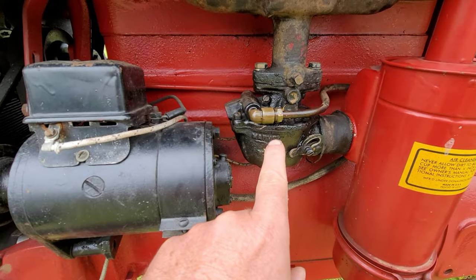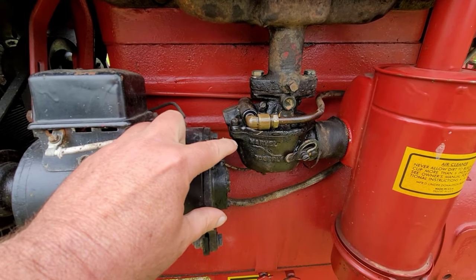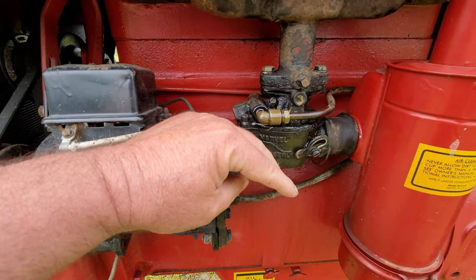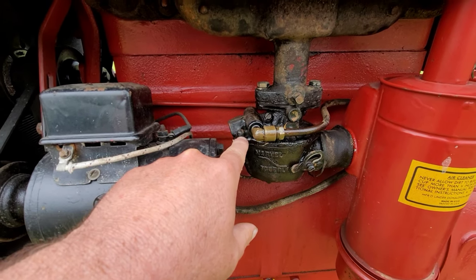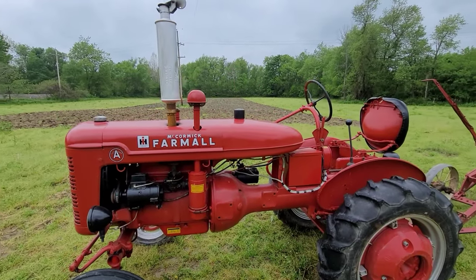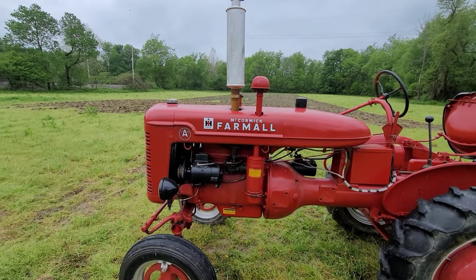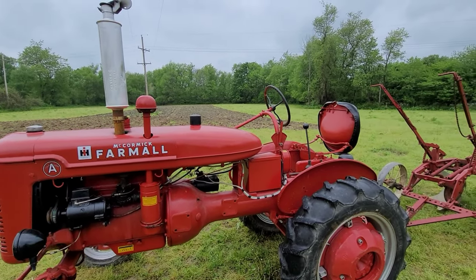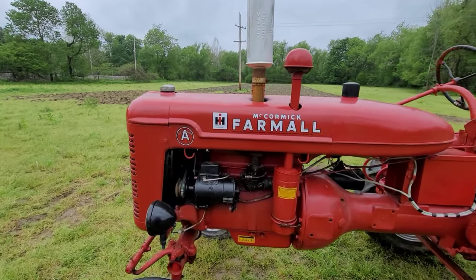Okay, there's nothing coming out of this carburetor. That tells me that needle valve is stuck closed up in that seat. Now likely the float's sticking down, but the needle valve is stuck up, and a lot of that has to do with the fact that it sat all winter. Did put non-ethanol in this, but it doesn't matter. The reality is the person that owned it before me probably ran ethanol fuel in this, and that carburetor has some gum in it and a little bit of stickiness.